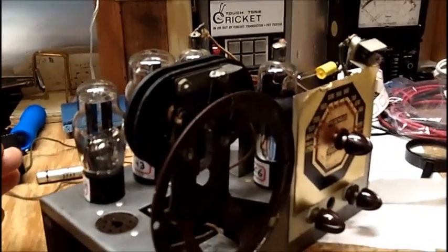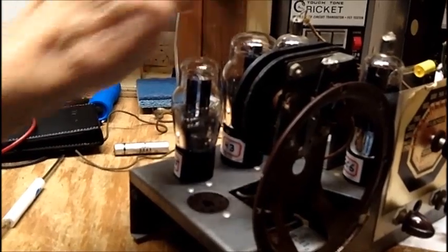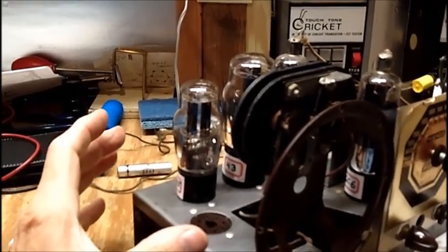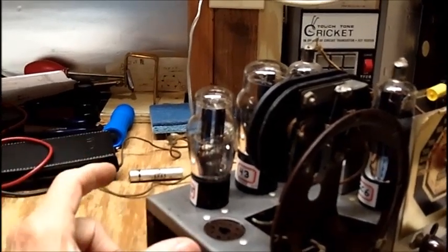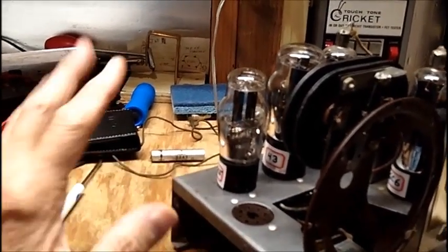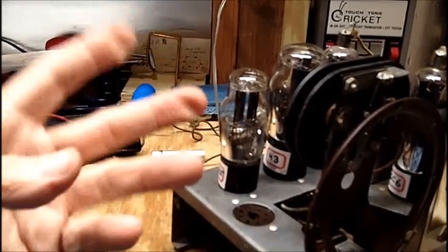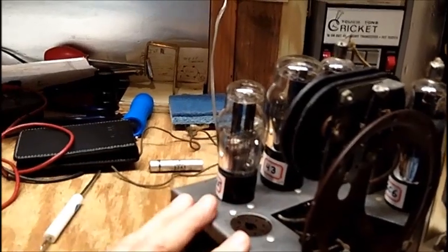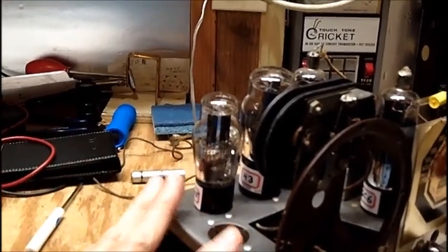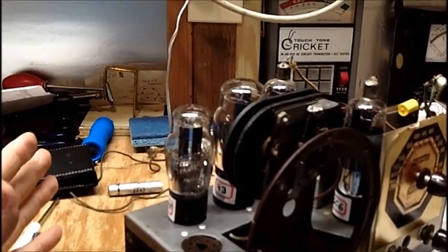And let's say I had an output transformer that would work on a tube similar to a 43 output tube, okay? You're following me so far? That's good. All right. Let's say I had that in hand, and I took an ohm meter and measured the DC resistance of the primary of that output transformer. Whatever that DC resistance is, there should be some kind of a formula or something to work. In other words, if it reads 400 ohms DC resistance, let's say, just throw out some figures, maybe it's an 800 ohm impedance transformer. I'm guessing. I'm totally guessing.